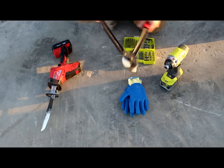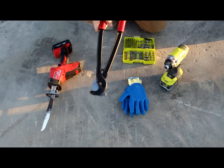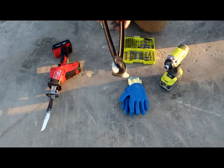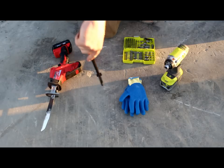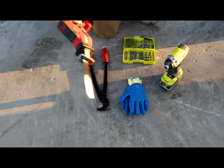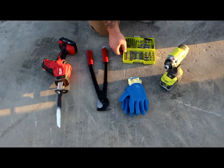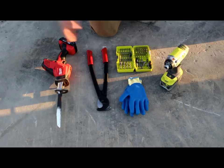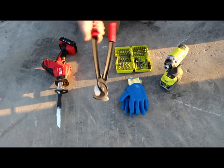A lot of people say you can't cut copper tubing with cable cutters because it'll dull them out — it hasn't for me. If you cut iron with them it's going to mess them up, so don't cut any iron. Especially if you get ACSR — you think you're cutting aluminum but you're really cutting iron, and that's going to wear those blades out. But other than that, I cut a lot of stuff with these — I think they're awesome. And then a Sawzall — just bought this the other day. I'm using a battery-operated Sawzall since I'm outside. I'm using all tools you could use at home. And you want a good bit set that has most of your bits, plus other tools in the tool bag you might need. You can take apart the majority of stuff with this setup — these are expensive but well worth it.